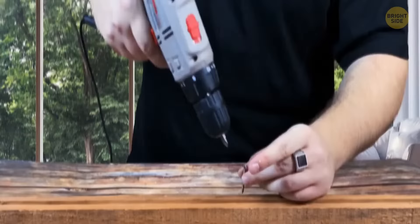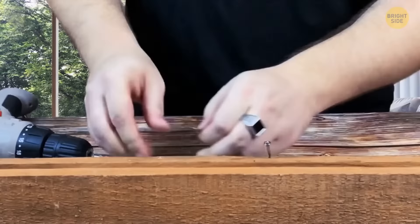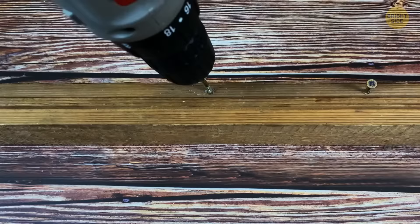While drilling long screws into hardwood, if your old drill doesn't have enough power, get a block of wax and scrape the edges of the screws with it before the drill gives up. The wax works like a lubricant, melting as it gets warm and providing easy entry for the screw.